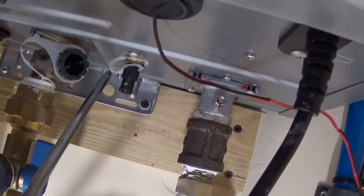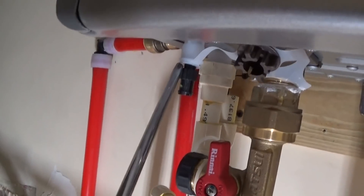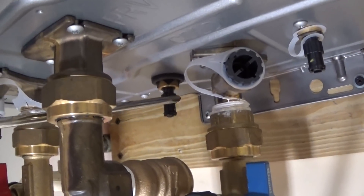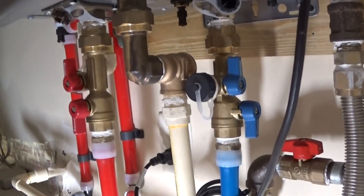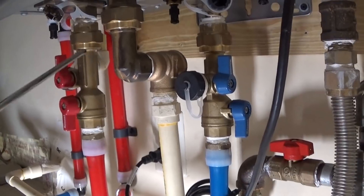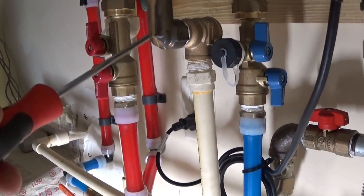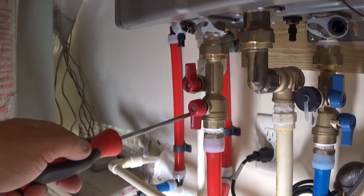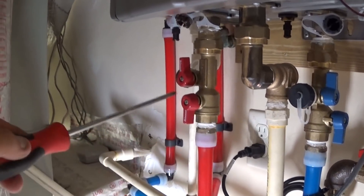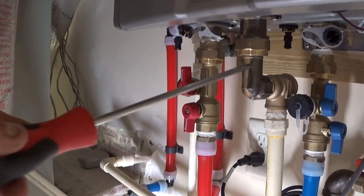This here is the drain for the condensate trap, and you can see there's a little water because we bled it out. This is the bleeder for the pump. Sequence of bleeding: once you turn the water back on, you want to open up the relief valve and bleed out — remember, you have a primary and secondary heat exchanger in here. On the new RUR Sensei units, the relief valve is no longer incorporated in the hot water side of the service valve kits that's supplied. This here will spin 360 degrees, so you have a big option of where you put the relief valve.